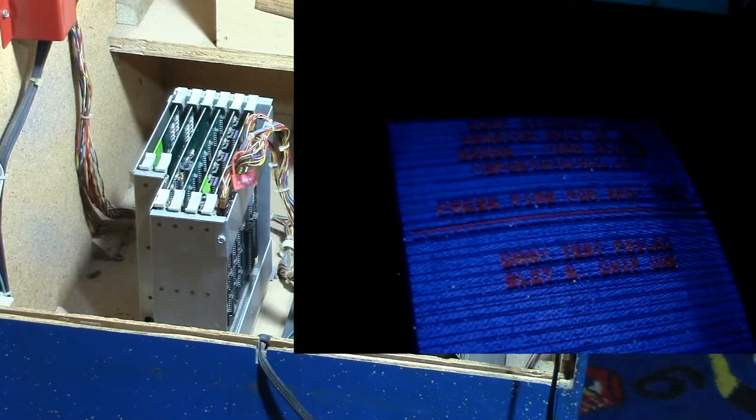Wouldn't that be funny? Alright, press fire for SRAM test. SRAM test passed. Okay, now press fire for DRAM test. Slot 6 chip U08. Well, at least it's a little bit different on the same row, but last time it was U7, so now it's U8. So let's go ahead and change that one.